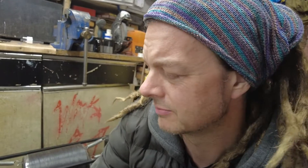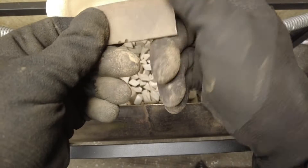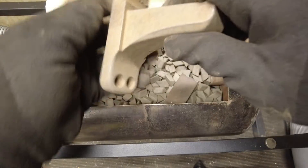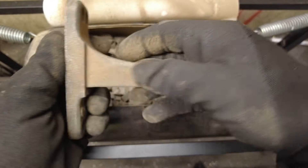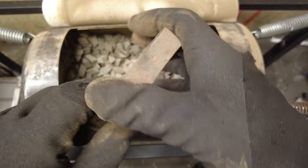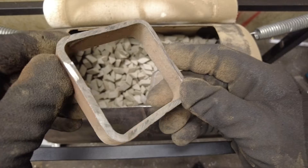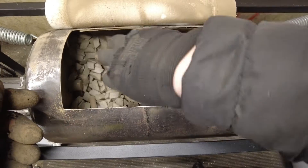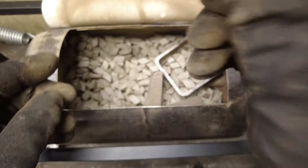It's loud, but it's not crazy loud. After running for an hour it looks kind of rusty in there, but it's cleaned the thick off. On the corners it's starting to look bright; the flat's not so good. The rust was really deep on some of the bits of metal, and it's made a good start even where it's heavily pitted. But look — there is no flash on that at all. Smooth as a baby's butt. So if you're looking at deflashing steel, absolutely amazing. The small bolt is well on its way too. Let's give it another hour.